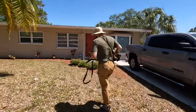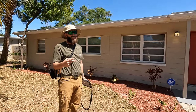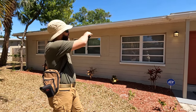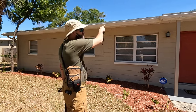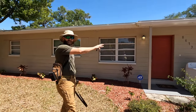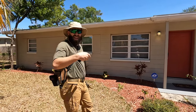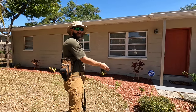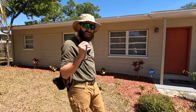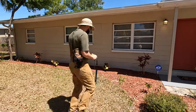So I'll start with my front elevation and then go into all my damage. Each damage shot should have two photos — a close-up and a perspective shot. You want to start categorized by item type: start with gutters, then windows, then siding, then doors, and go in order. Keep it all categorized so the file reviewer can easily see it — gutter photo followed by the next five gutter damage photos, then window photo followed by window damage. It keeps it in order so the reviewer can get through the file fast.